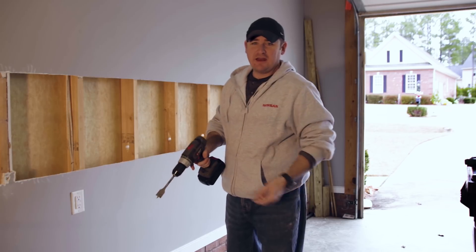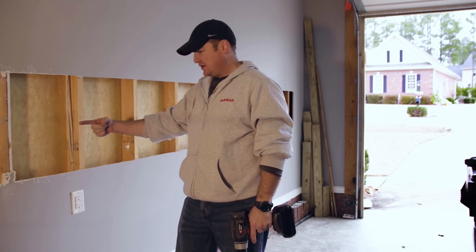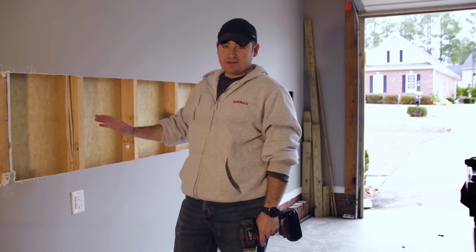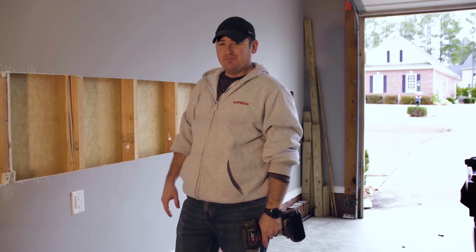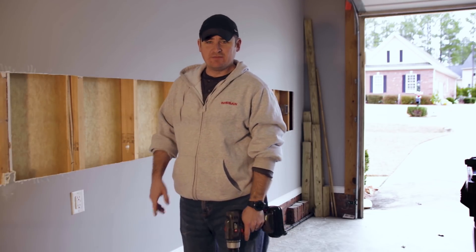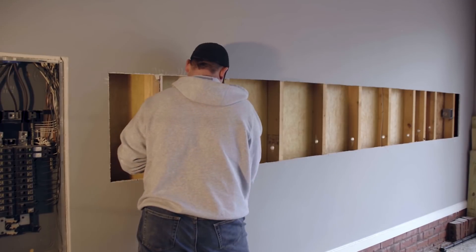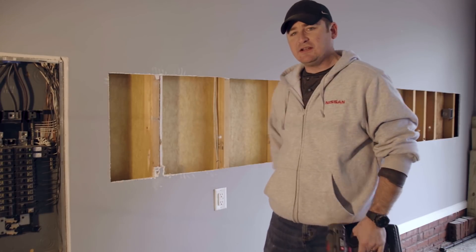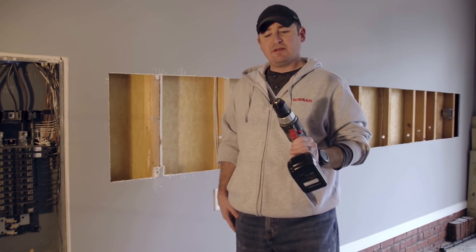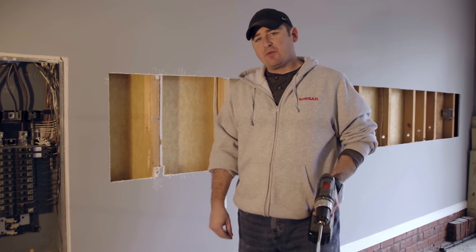Had a visitor and had to change batteries. Almost started drilling through the stud in the wrong direction — that would have been bad, here's the electrical wires and electricity is still on. Always double check, don't rush through things, and keep an eye out for electrical wires. We got all the holes drilled through the studs using a one-inch paddle bit, which makes a one-inch diameter hole — plenty fine for the wire we're using.